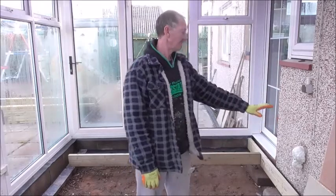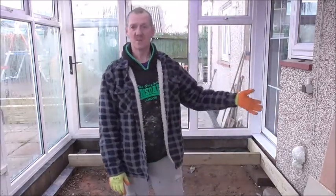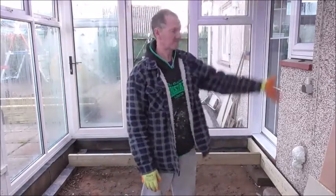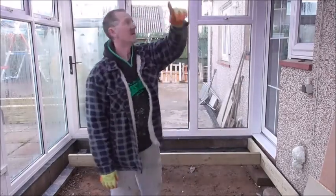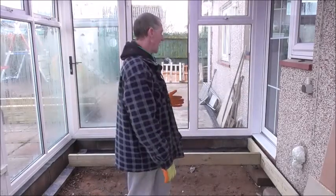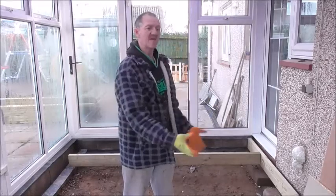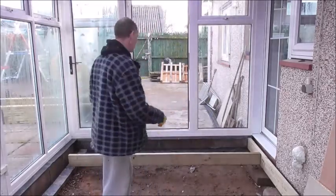A few spurs there will spur down the socket ring to do the lights, because I'm not going to be able to get through to the light circuit, so I'll just spur down a cable at 5 amps to give me lights across the top there and put it into that box. Then things need to be thought of as you're doing, but initially when you're doing the floor, get the cables in. The first fix was here, cables and pipes, get them in.